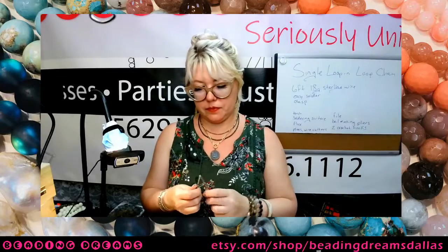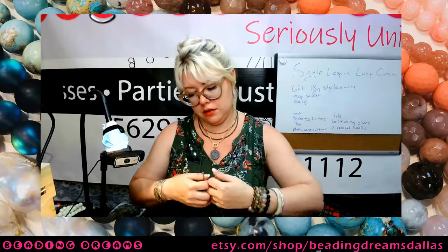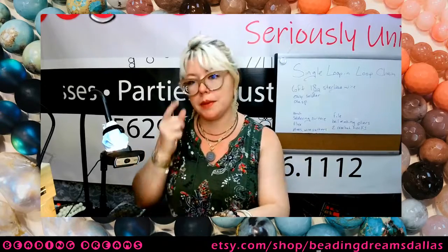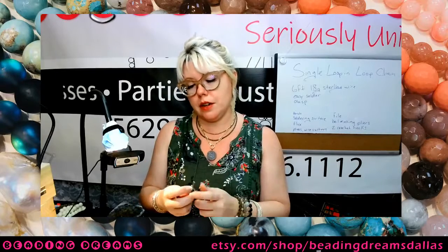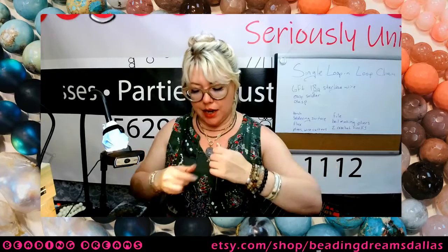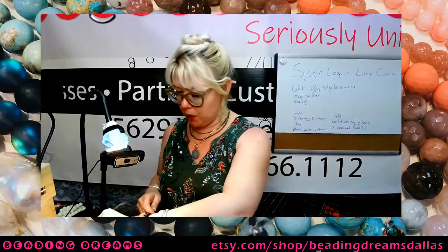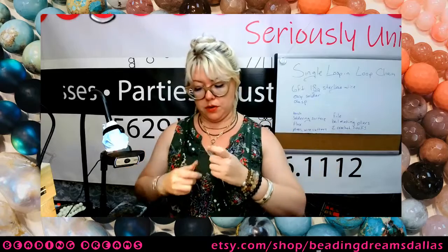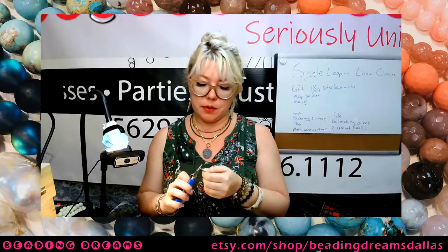Three more to go. So once again, don't be like me. Learn from my mistakes. Make bigger circles the first couple times you do this, because the assembly is so much easier if your circles are larger, like the ones that I have made, which I think are about an inch in diameter with the spring up and everything, versus the ones that I did for my prototype, which are closer to 3/4 of an inch. It doesn't seem like that 1/4 of an inch would make as much of a difference as it does, but trust me, it's huge. So much easier to assemble the bigger links.